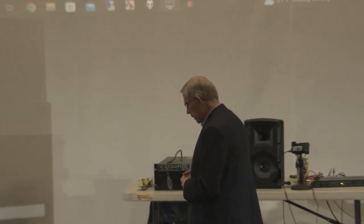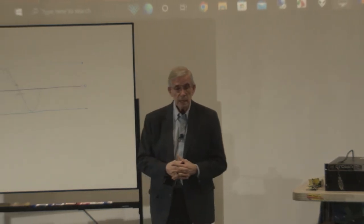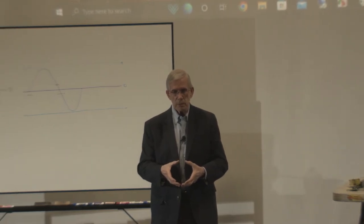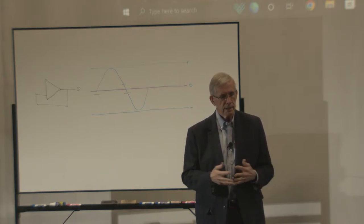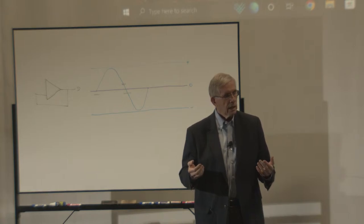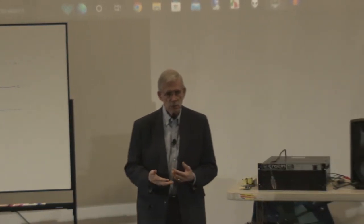Well, speakers are rated a lot different than amplifiers are, because usually speakers will have a peak power to them. Like we said here, if a speaker for a tenth of a second can take 1,000 watts, where it's a 100-watt speaker, and you want to reproduce that peak accurately, without it ever going into clipping, or without it ever destroying the loudspeaker, I should say, you need a 1,000-watt amplifier to do it. So the answer to Tyler's question is, it depends on what you're using it for.